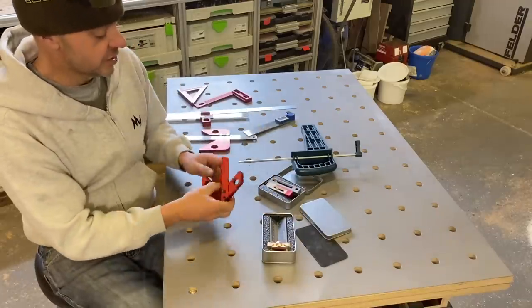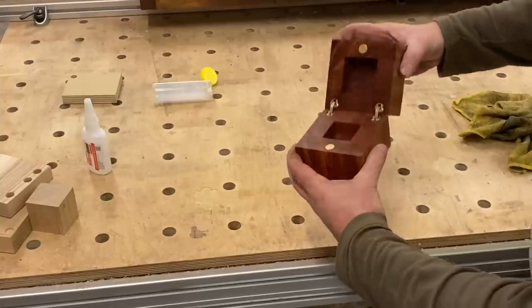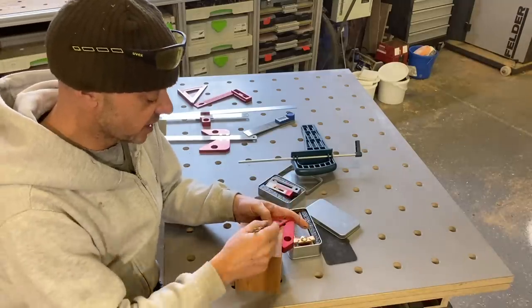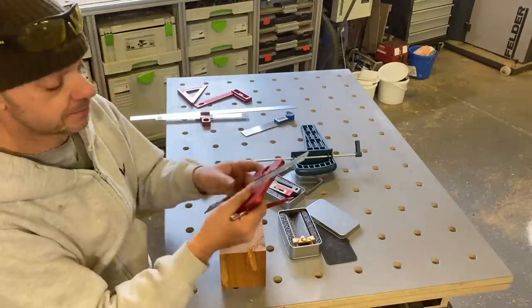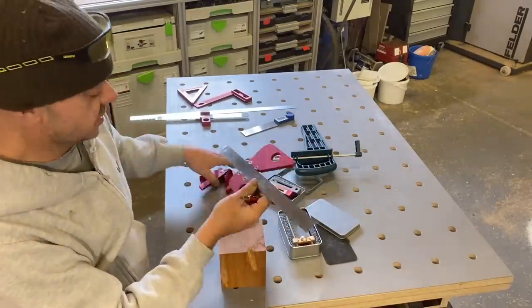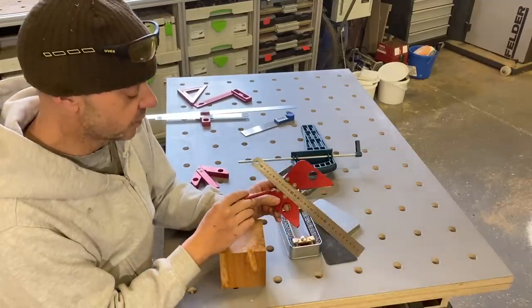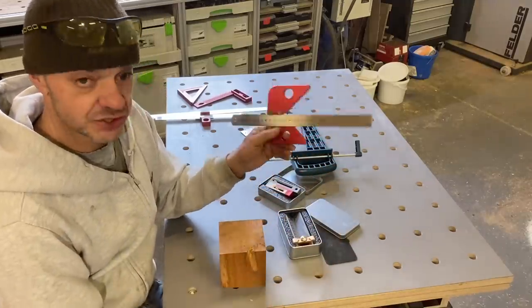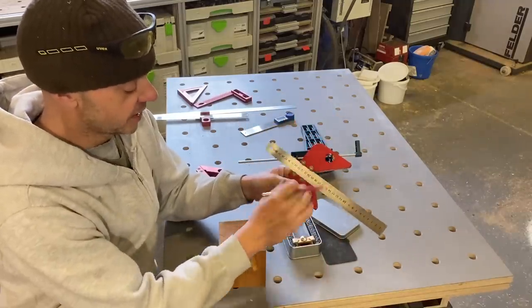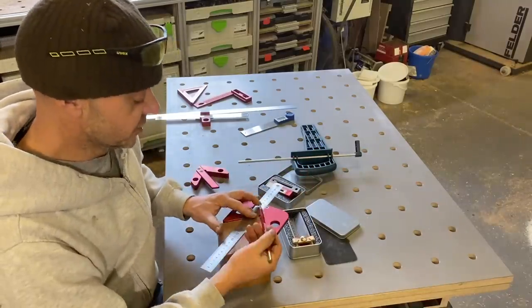This one's really good - you've seen me use this before. Let me get a little bit of wood to show you. This is a piece of damson - there's another project coming soon, a little box. So I'll come up with this here and you can mark in across like that, and you can obviously go all the way around. But with this new one you've got a ruler and it's much longer, so you can mark it in one hit. You can also use the ruler for an offset stop. All I did was open it - it comes with an allen key. I did up the four grub screws, didn't play with any wiggle adjustment. It comes straight out like that, bang-on accurate. It's got a little rebate so you can sneak your pencil right in there.